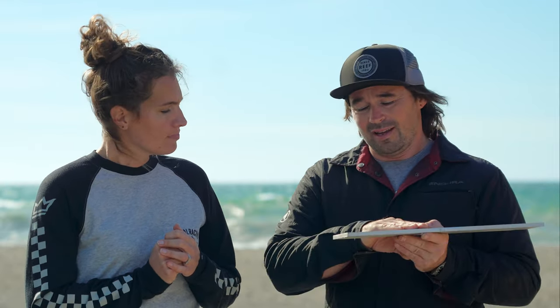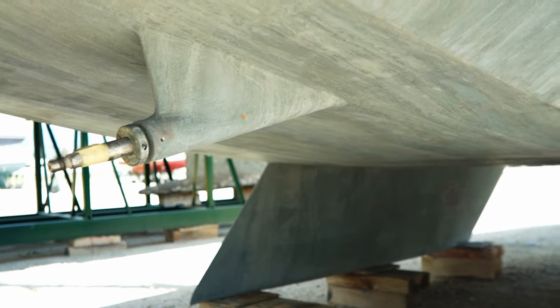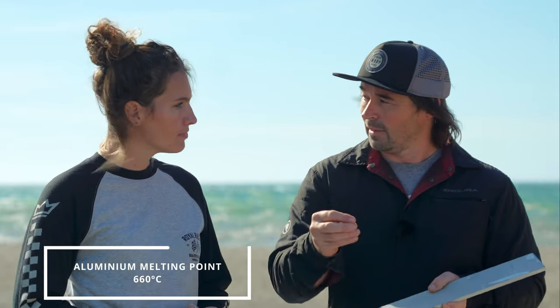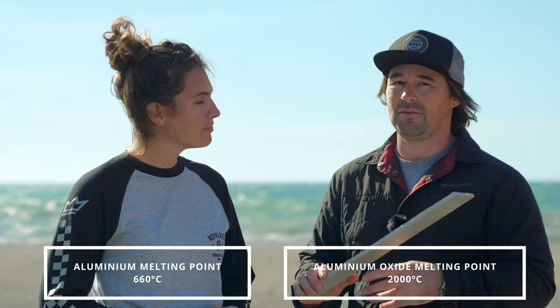The other really interesting thing about aluminium is its ability to create a second skin almost instantly. In welding it happens within seconds, but in seawater within a day or two you create a hard film on the surface — a chalky white aluminium oxide layer. It's really strong; it's actually what we make sandpaper abrasives from. This is also why aluminium is hard to weld: the aluminium has a melting point we need to reach, but we first have to break through the oxide layer which has a higher melting point. That's why two specialist welding techniques are required.